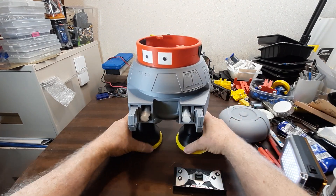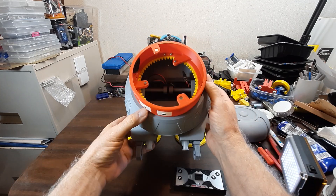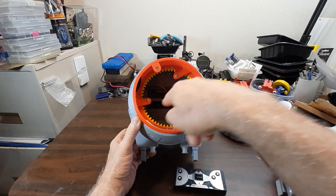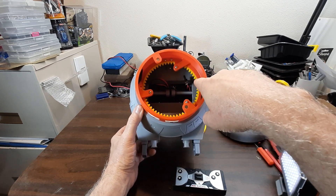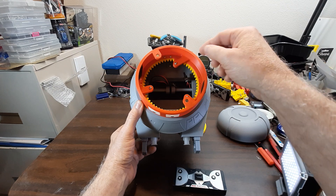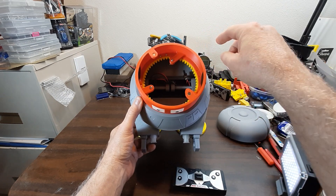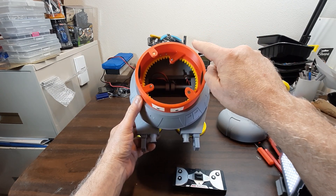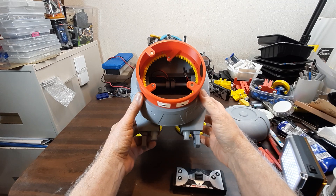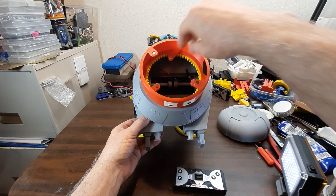To get this big gear in there, it's split right here — so it's two pieces — and there's another separate part that goes on top and clamps it on the little ridge that goes around the top so it can't come out. This head part is a separate part — I believe I should have done it in the first place. I'll make this ring and this part into a single part.